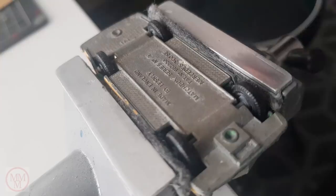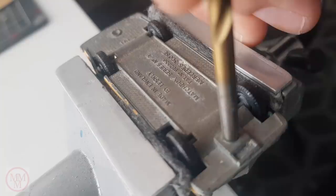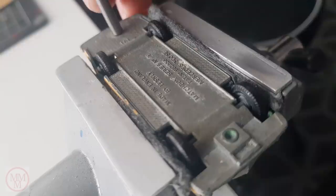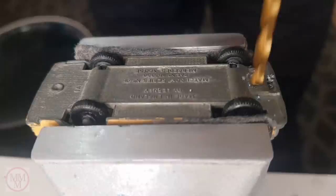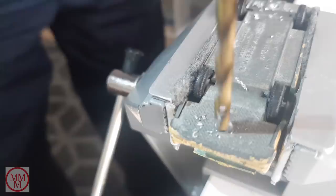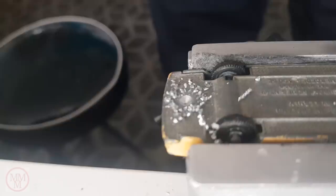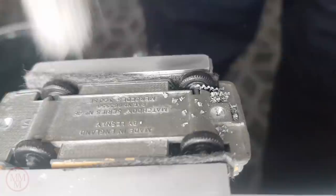So now, as usual, it is time to put the model in the vise and drill out the rivets so I can start pulling it apart. The drill size I use is the exact diameter of the head of the rivet - I always try to remove the least amount of metal. If you accidentally drill right through the base, you have to use large screws or rivets to secure it back and the end result does not look too good.